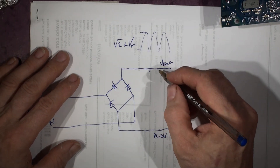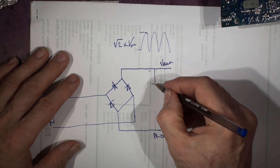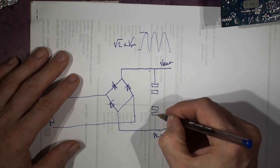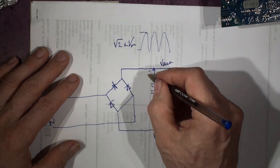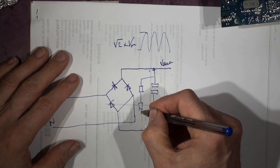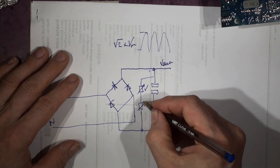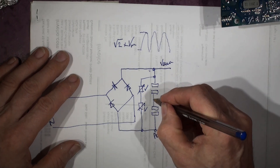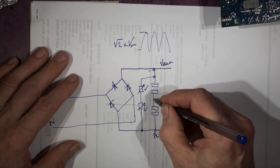So what they've got inside these units are two capacitors. It's very common — JBL uses the same thing. There are two electrolytic capacitors. And on the Bose, there are a couple of voltage-dependent resistors that go across, to stop this center-tap voltage wandering. There's a center point here.